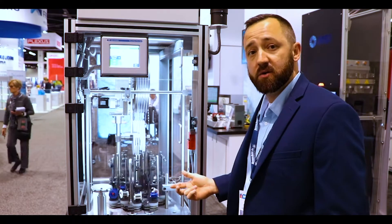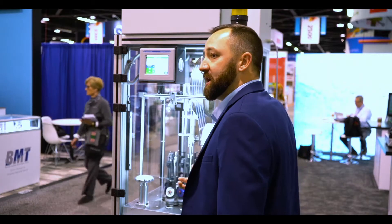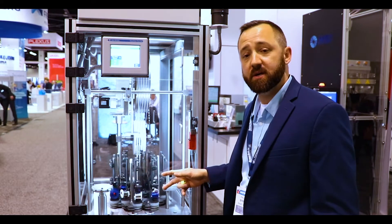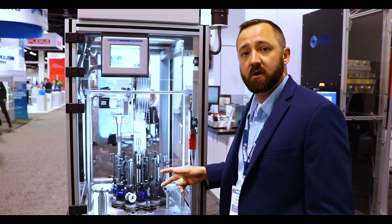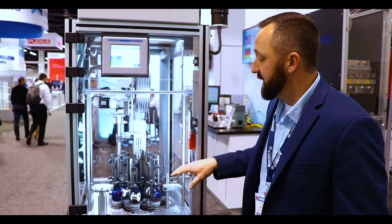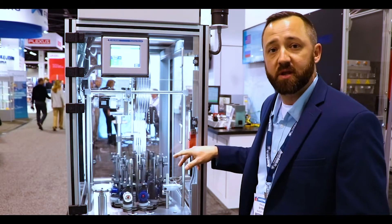Based on the size of the material that you're going to be braiding with, the carriers can tension that material to the best that we can do for that core that needs to lay down. You can see here that this is the 80 millimeter horn gear and it also has some triaxials going into it.